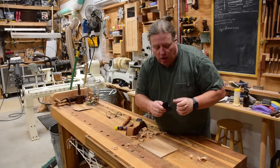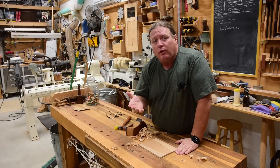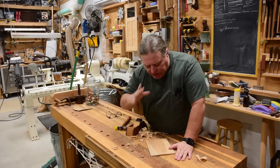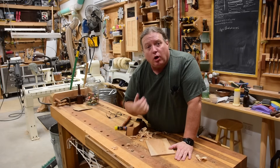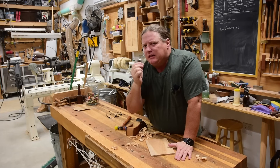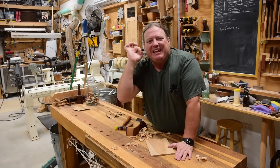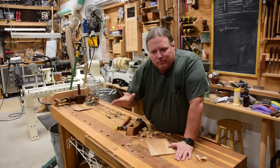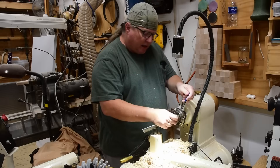This is not unique to hand tool furniture making — you see the same thing being done in the wood turning world and in the hand carving world. I'm basically burnishing the fibers and I really don't know how to explain what's happening at the cellular level. In a previous tips video I've talked about bruising the wood — we are in fact bruising the very top layer — but when you're burnishing, for some reason it doesn't affect oil absorption differently, it just lays it down flatter. You're not going to see the lines that a bruised fiber does, but bruised fiber goes down into the wood, it crushes the cells — we're evenly crushing them.